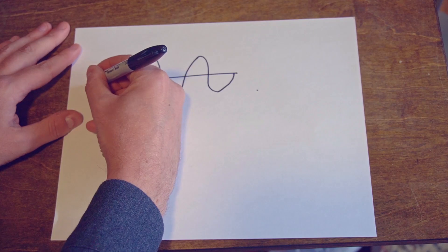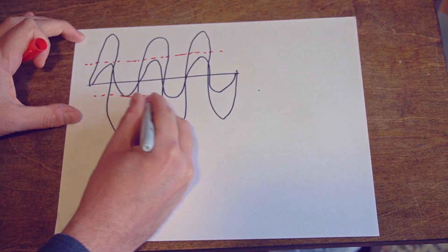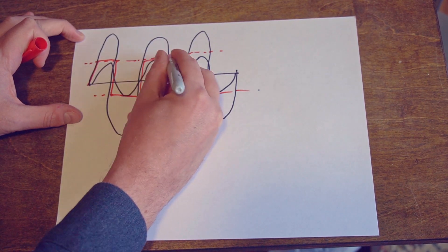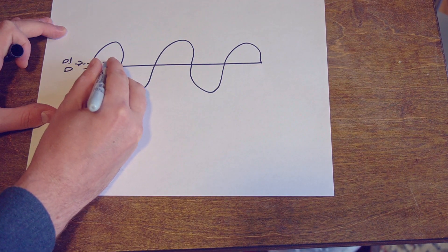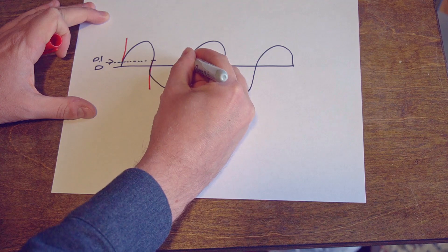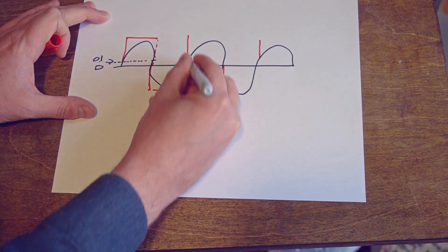What makes this ultra is that it's not a distortion. If we think about an audio waveform and how a normal distortion circuit works: we have some incoming audio signal, distortion will amplify that signal, then it will clip on the tops at some desired level, leaving you with a waveform that much more closely resembles a square wave. A comparator fuzz has a slightly different principle — rather than simply clipping off the top of each waveform, you set a threshold value, and anytime this waveform crosses that threshold the comparator outputs either a one or a zero, giving you a series of hard edges which form an actual square wave output.